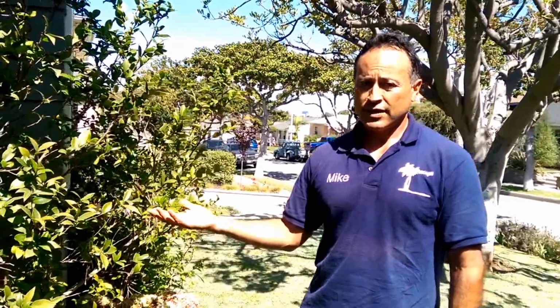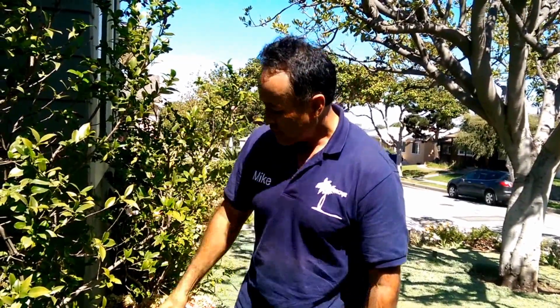I would recommend the homeowner actually have a professional company raise the valves, and then they'll raise the filter. Then they'll be able to get to it. Poor installation. But that's why I'm saying that if you're contemplating drip irrigation, make sure the installer knows his stuff, knows to leave these valves. How high are you going to leave the valves? At least 12 to 18 inches high. If they're going to leave those 6 inches high, poor design, they get a big fat F.